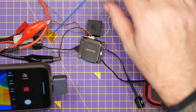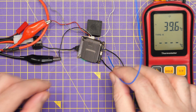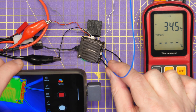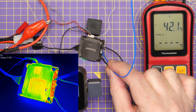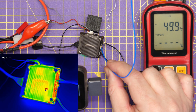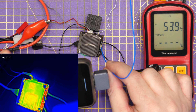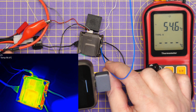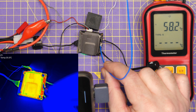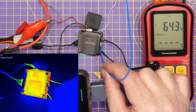Unfortunately the heat has lifted the thermocouple — absolutely typical. It's still on but it has actually lifted, so I'm going to move the thermocouple to the area where we were seeing very high temps and see what we get. The thermal is reading 90 degrees but looking at what the thermocouple is showing, we're getting closer to 60 degrees — quite a difference in the results.